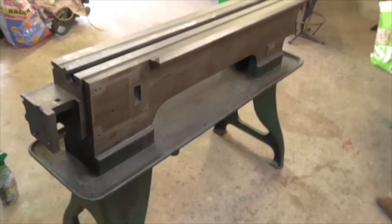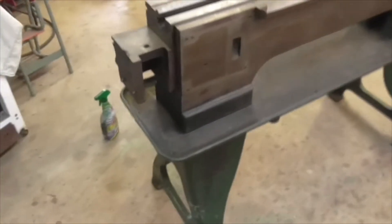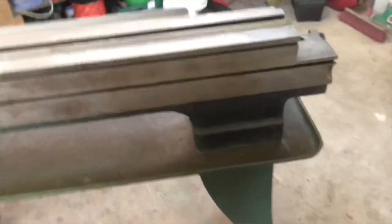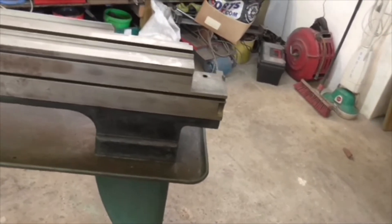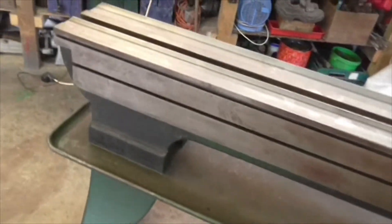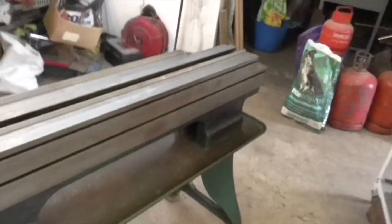Thursday, 5 to 5. We've had a very good clean-out of the inside of the bed and we've got a lot of the green paint off because it hasn't been degreased underneath. It seems pretty stuck on the legs though - if it's good on the legs I'll leave it on because there's no point stripping off good paintwork. I should just paint over it. I've wiped it down with white spirit and a lot of the marks I thought were rust were actually just congealed oil. It's actually quite clean inside there.